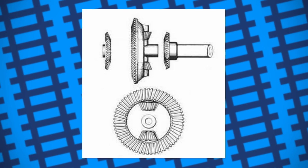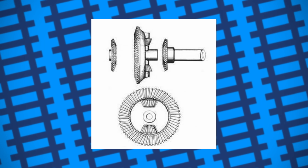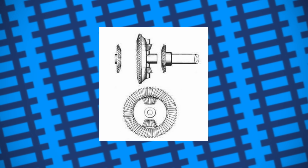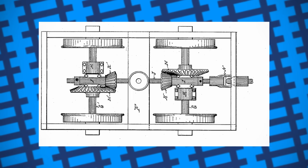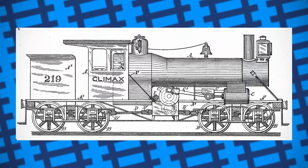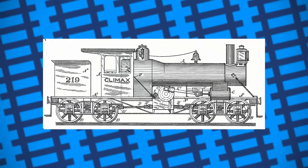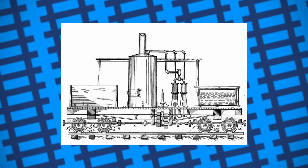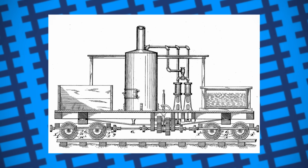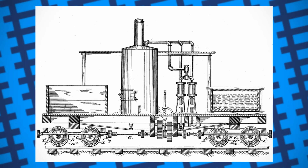The wheels of the engine were driven with differential gears, the idea being that wheels on one side of the axle would be able to rotate freely to help the engine negotiate tighter turns. In reality, this left half the wheels on the locomotive unpowered, which significantly reduced its tractive effort. An engineer at the Climax Company, Rush S. Battles, then patented an improved design which used beveled gears to drive the wheels. Later drawings had the boiler be much bigger and mounted horizontally along with its cylinders. Once again, this patent was filed without a single mention of Scott. Scott, fed up with the disrespect, filed a lawsuit against Gilbert and Battles before submitting his own patent, which combined the basic design and two-speed gearbox of Gilbert's engine with the bevelled gearing of Battles, but this time with casing around the gears for protection and to contain lubrication.